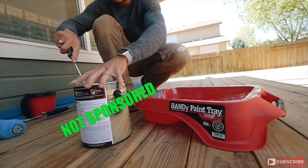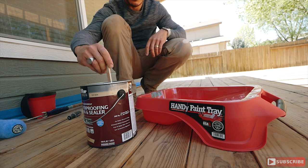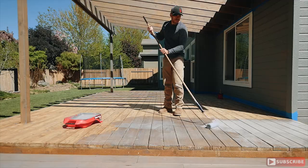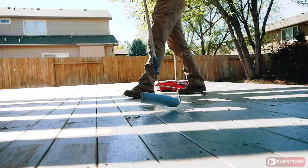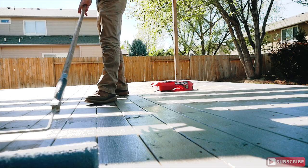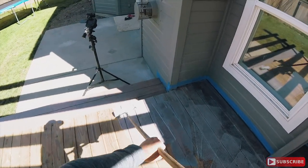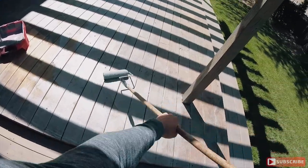When it comes to my new stain, I decided to try some products from Behr. I went with the premium version because they claim the stain lasts a lot longer — four years on decks instead of two, and eight years on fences. I stayed within the semi-transparent family because stain tends to either rub off or chip like a solid paint stain, and I'd rather reapply an extra coat than re-sand chipped surfaces or strip the area again. I applied two coats to the deck and one coat to the pergola, then let it dry overnight before walking on it. I tried going against the grain and didn't see any change in quality — so this stuff is pretty strong and durable. I'm really curious to report back in two years and see if it lasts the four years they're promising.